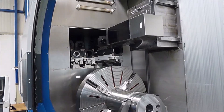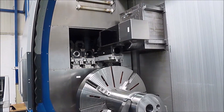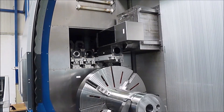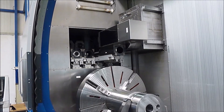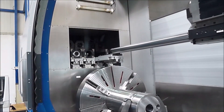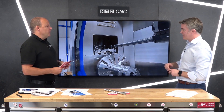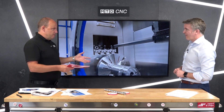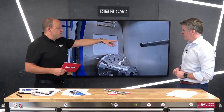Right now we're picking up a boring bar, but above the main spindle we're picking up a deep hole boring bar using the side of the spindle to give better rigidity. So we're not actually picking up with the spindle interface itself, meaning there are fewer couples and therefore more rigidity, because it's been secured in far more areas.